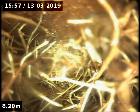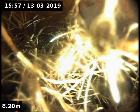And here we go. This is our roots are here. We should be able to clear that hopefully. I'll locate that. This is just before the footpath. It's just before the footpath, 0.25 deep in the driveway. I'll mark it in white paint. We'll try and clear that.